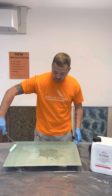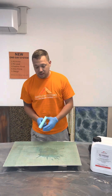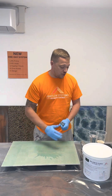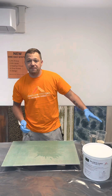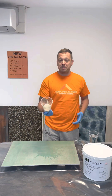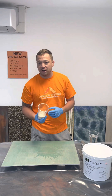Once that's done, you then apply your levelling compound — your self-smoothing compound — which is the GenCrete RS. Now that's dry, this brings us on to the GenCrete Feather Finish. I've got some here in a cup — like I said, it's a beige colour, so it dries the same colour as our self-smoothing compound, the GenCrete RS.